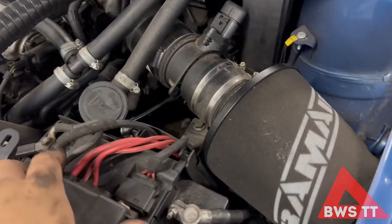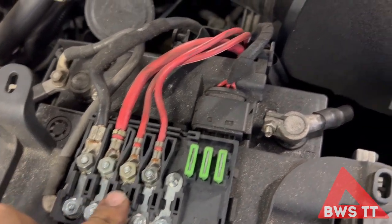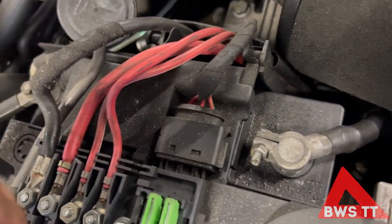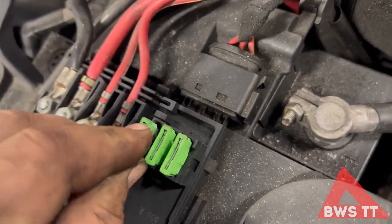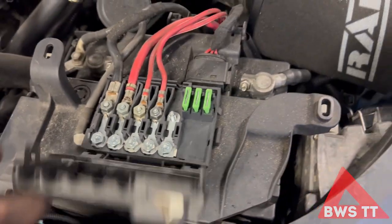So under here, I've got a fuse here. This one controls the relay for the high speed and this one here is for the low speed fans. Now both your fuses are fine — this one looks okay. And if the contacts inside there are good, which they look to be, and if this one doesn't look like it's melted, then we move on to the next step.